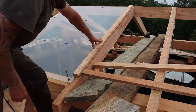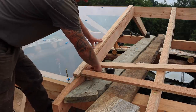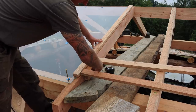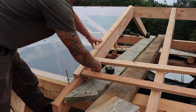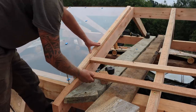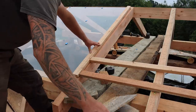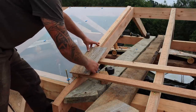That worked well for the greenhouse. And then I have to put an additional piece of batten along this rafter under there to support the battening. So then the battening will come along, let's just move that over to imitate that a bit. So the battening will come along and sit on that other piece, and they'll be at the same height. And then we'll have wooden roof shingles on top of all of that,